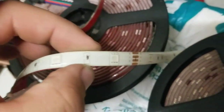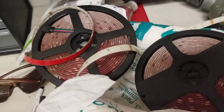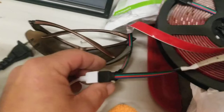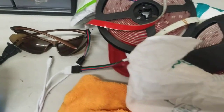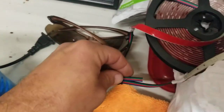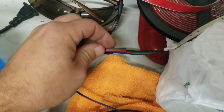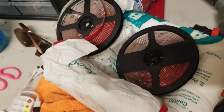Because that rope light is a lot narrower than this LED strip and the hole in the mirror is so small, what I'm going to do is start at the plug and just cut it right here. That way these small wires can go through the hole, and I have a whole roll of extra wire — once through the hole I'll splice these wires in and continue it down to the controller, same for the other side.